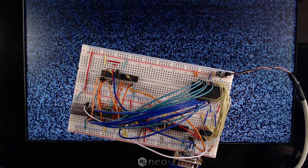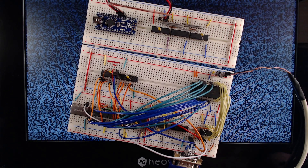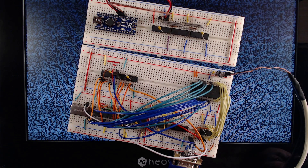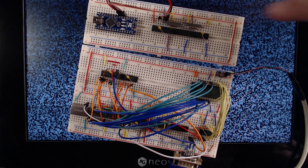Usually a CPU will have some sort of memory address register, or MAR, pointing to a location in RAM. It will have a data bus and a control signal that indicates that the current data should be written into RAM. Since we are only concerned with the VGA side of things here, I'm going to use this dummy CPU setup of an Arduino Nano together with 74HC595 serial-in parallel-out shift registers. The first two ICs will be the MAR and the third one here will play the data bus.